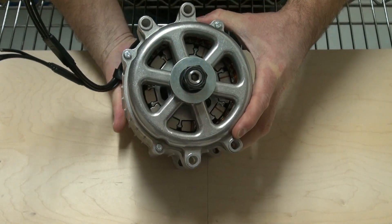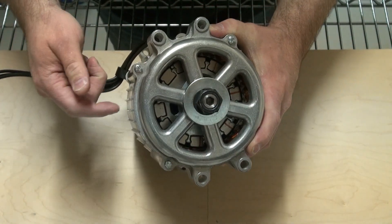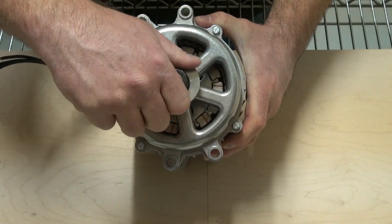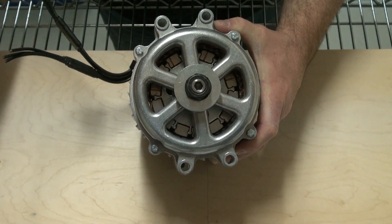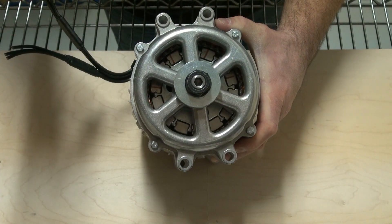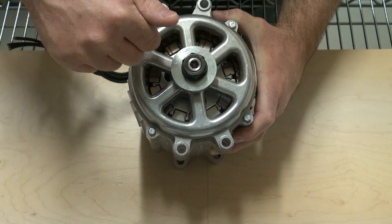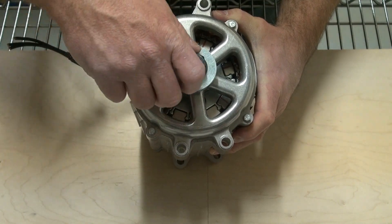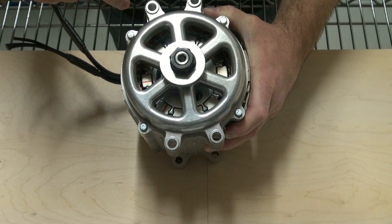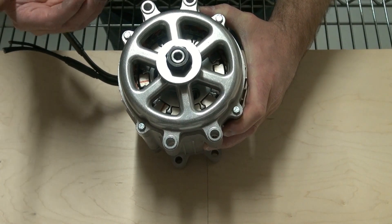This is what shocked me the most from the tests we've been doing. With my old Missouri Wind & Solar Renegade 24-volt dual-core PMA, I can just take this one and spin it with my fingers — that's just as fast as I can turn it. There's almost no cogging at all on this thing. As I define it, cogging is the resistance of the magnets to either the magnets or the copper on the inside. When there's no cogging, it allows for a lower startup speed, faster power generation, and when the wind's blowing, constant wind means constant power.